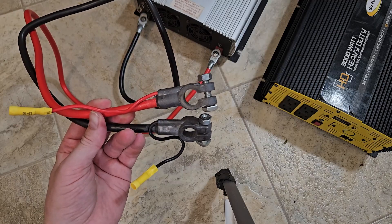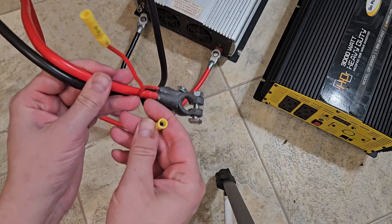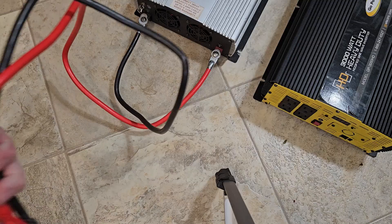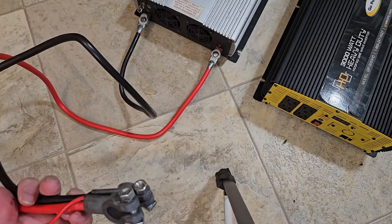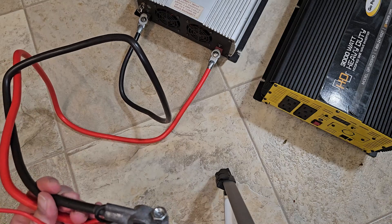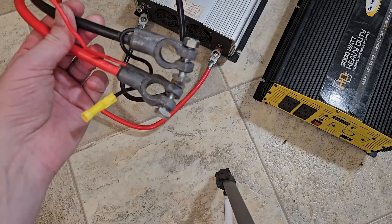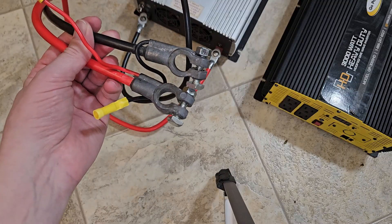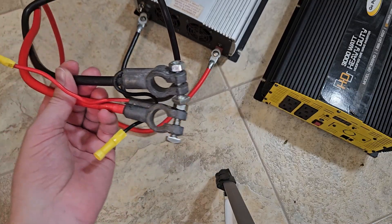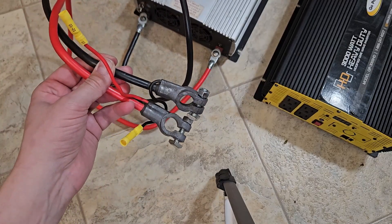So I purposely wired this one up wrong. We bought a little battery hookup kit — you've got the voltage test points, nice solid lead on there, but kind of thin gauge cable. You want to go at least four gauge depending upon the distance. To pull 130 watts to power a fridge you don't need that thick a cable, but the problem is, what if something goes wrong and it starts melting? You can't quickly disconnect it. So never just go direct to the battery — that is dangerous.